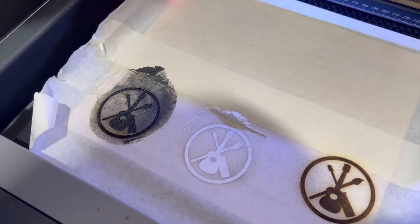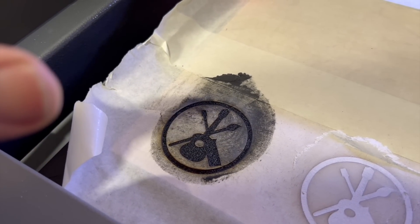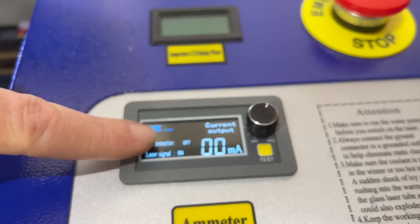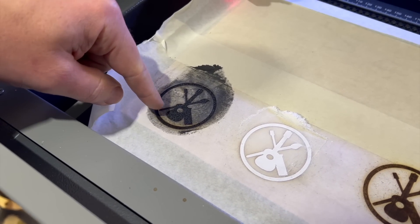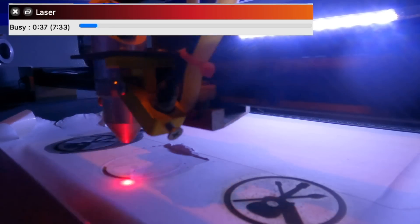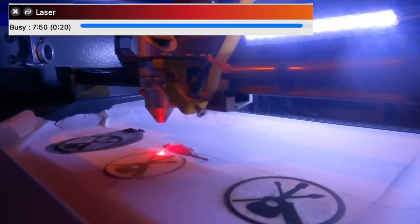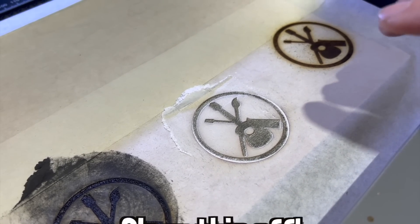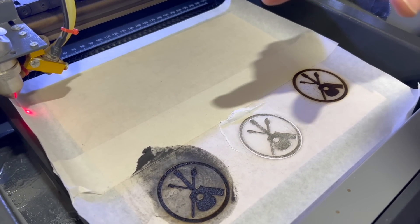It just finished with the black and we got pretty good results. With the computer we can only turn it down to about 22% before the laser won't fire, but we have additional controls on the dial and turned it down further — and the laser was still firing. You can see we got some pretty good results. Now let's test the white. Well, that didn't work out so well — white doesn't seem to work in here. So we're going to clean this off, get air assist back on, engrave our top three, and use the heat gun method.